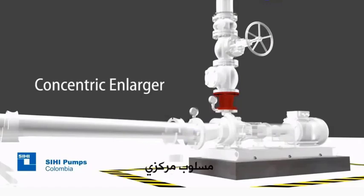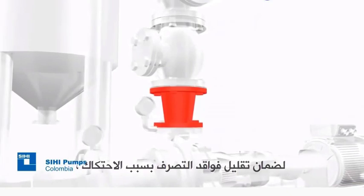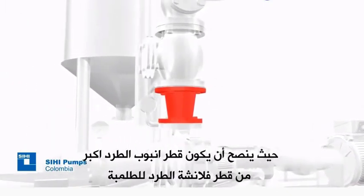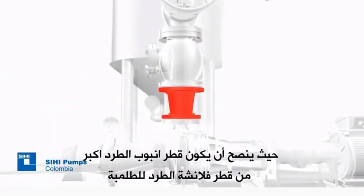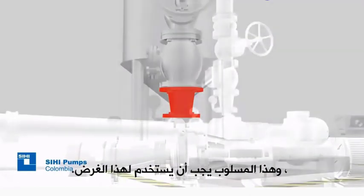Concentric enlarger. To ensure that the discharge losses due to friction are low, it is advisable that the pipe diameter be greater than the pump flange nominal diameter. Concentric enlargers must be used with this purpose.